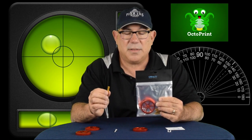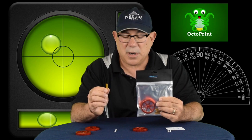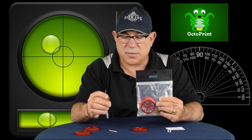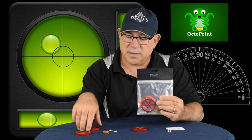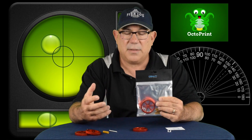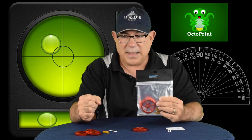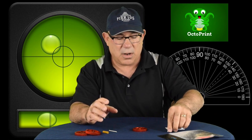The new spring is yellow — the ones on the machine are orange. It comes with a new screw, though you can use the old screws if you want. This stiffer spring is going to help us maintain level, and then we'll use OctoPrint bed visualizer to re-level the bed, which is where we bring in a couple of extra tools.